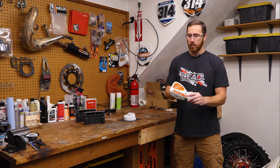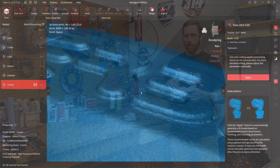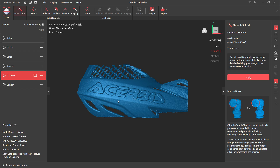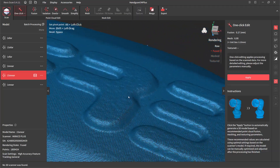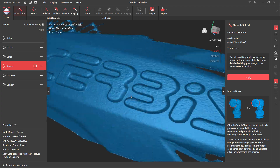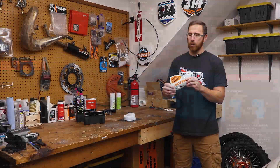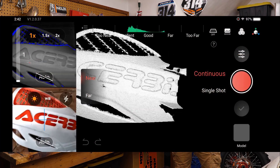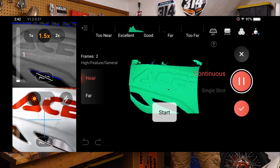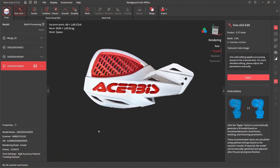When we take a look at the brush guard, this is a situation where IR Optical Zoom does actually help. The main area we're going to see it help is at the base or corners between the letters and the rest of the model. The self-shadowing at the corners of these letters — because they are quite a bit taller than casting marks — means we're not going to get good information bouncing back to the scanner. Using the IR illumination to focus into those areas is going to get us better resolution at the root or corners of those transitions, and some of the angles will certainly benefit from IR Optical Zoom.